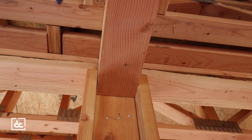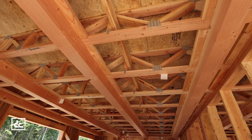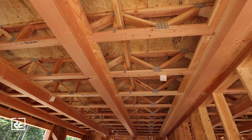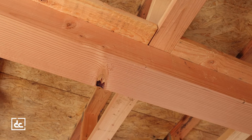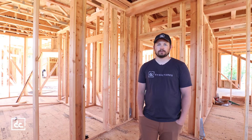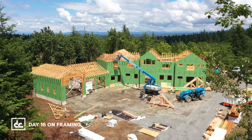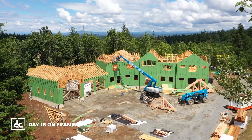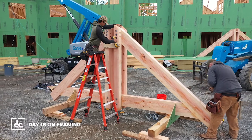With our simple build system, you can see all these beams floating across these ceilings — we dropped them in during the framing stage. I really think that's the best way to do beam work on a ceiling, because we can get the drywall around them without spending a bunch of time with finished carpenters trying to get these in on site. They get prepped and finished the same way all the other timbers in the house do, to really make it look like one seamless installation.